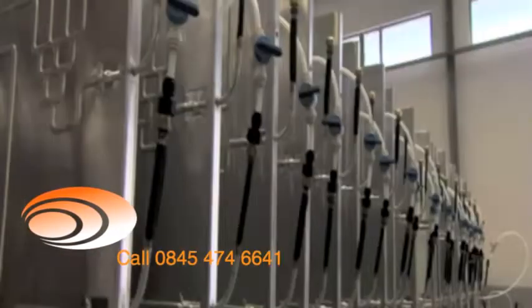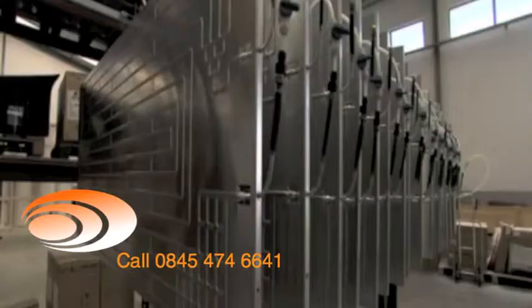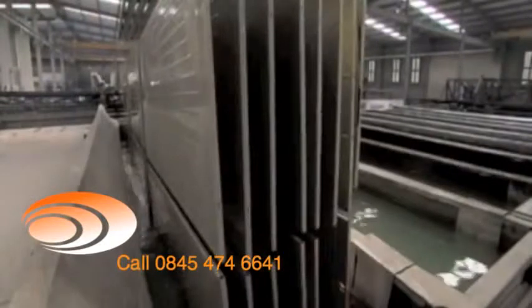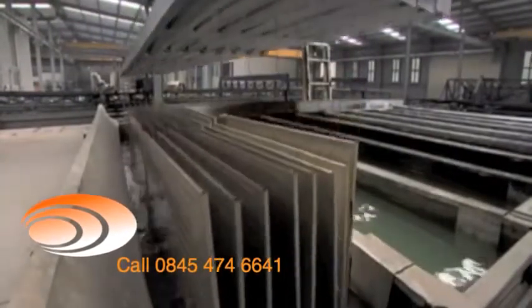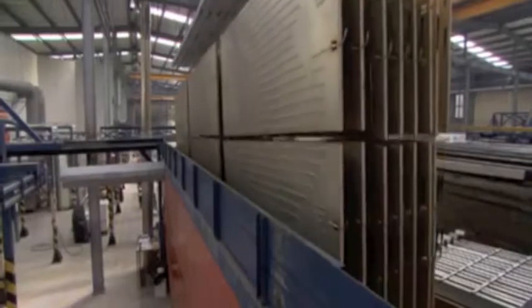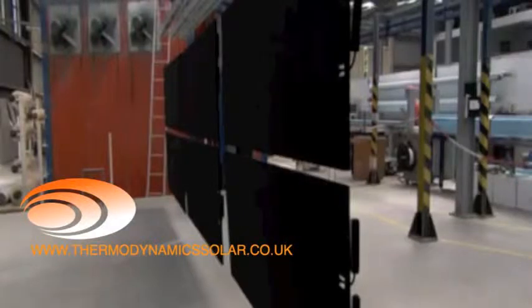The solar panel is made of aluminium sheet, which goes through different stages and high-technology processes. It is previously coated with an anodized layer and with a selective surface finishing. Its size, robustness and treatment afford the ability to withstand impacts generated by bad weather, as well as environmental stressors such as rain, UV rays and hail. Weighing only 8 kilos, the panel has countless installation advantages, with dimensions of only 2 meters long by 80 centimeters high.